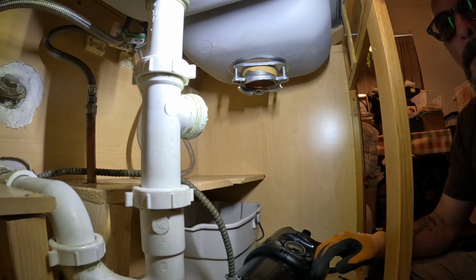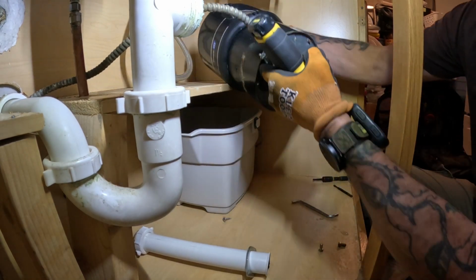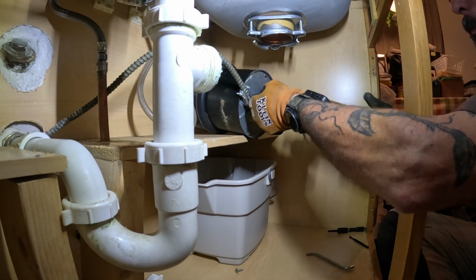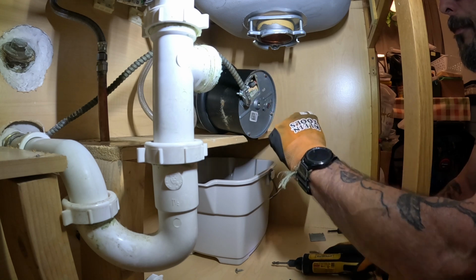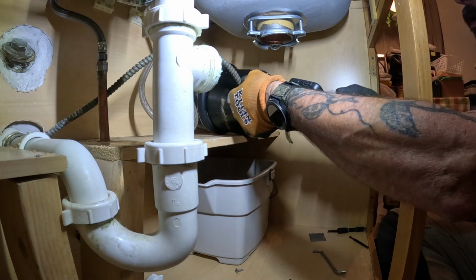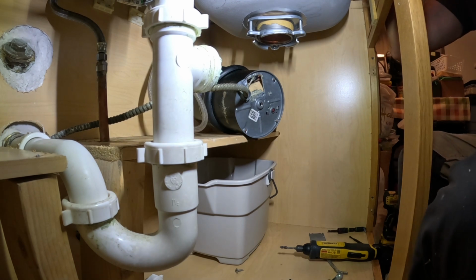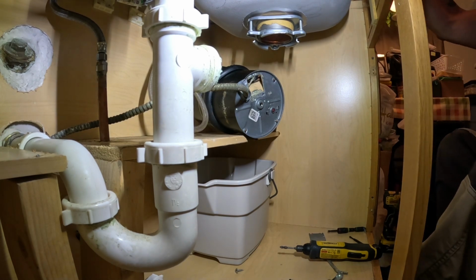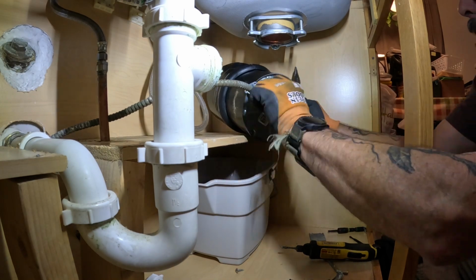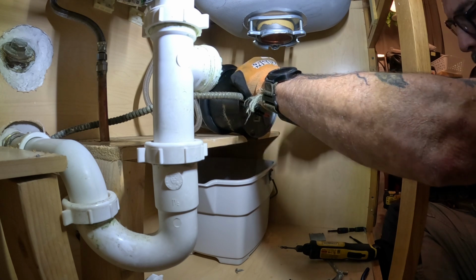So, on the electrical, it's a pretty easy disconnect. We'll set it up here so I can get a little better view. Just take the little screw out of the bottom. Yeah, you can see the water. There's water in there. Because you ran it, let bottle caps in there. Bottle caps will crack the case, and that's what happened. Where's my freaking needle nose at? There we go. I just gotta get in there. That's the reason why it wasn't showing a big leak, because it's just cracked.